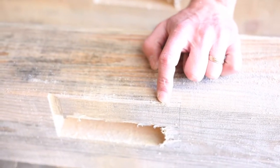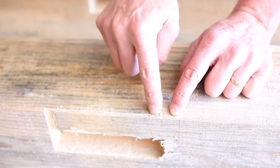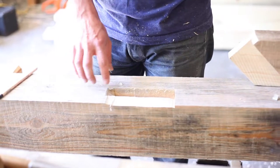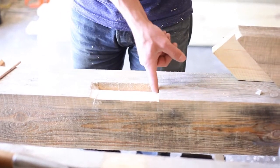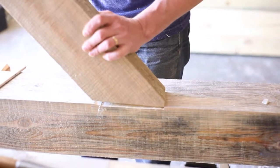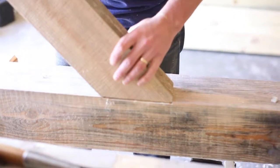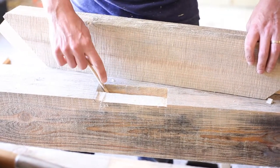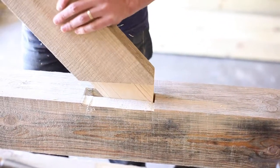I'm not going to go all the way — I'll leave some material and then depending on the width of my brace, I'll lay that in to determine where I make the 45-degree cut. I'll still clean this part up with the chisel, but I've set the vertical edge. I push this in to see about how much we have to take off, and I've also used the chisel to knock off a 45-degree angle right here so that this portion of the brace can slide in just like that.